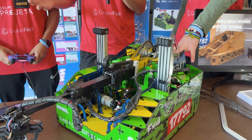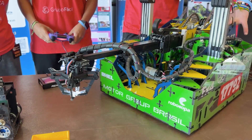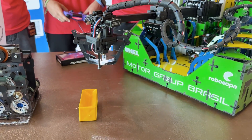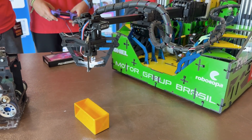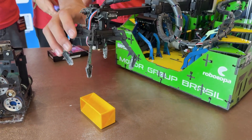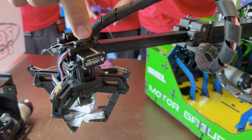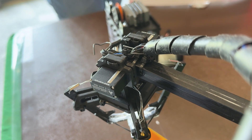It's a new design — there isn't anything on the market like it, so they had to develop every part of the claw. Getting a good finger geometry was very difficult because the finger is thin, so it needs to grab samples and keep them in the claw. Coming up with the finger design was one of the big challenges. At the same time, making the claw strong enough to withstand submersible impacts while keeping the malleability of the system was key — the whole claw is malleable, so when another robot hits it, it can deform a little rather than break. The axle arm is only tied with zip ties — no screws on top of the box tube.